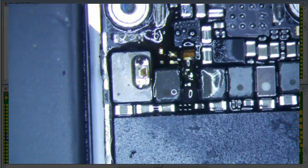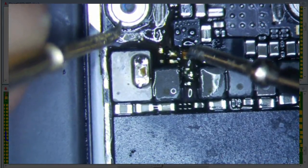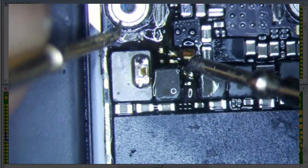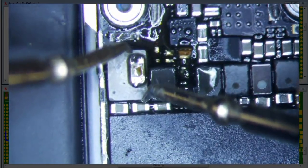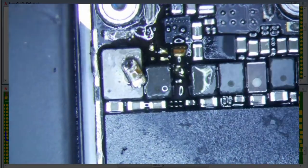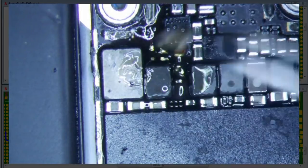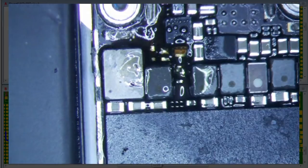And all right, so let's do diode mode one more time, and let's see if the short's relieved or not. That was ground. So this is 0.60. So short is relieved. Let's measure this cap, make sure this will confirm. 0.013. Okay, so this cap is bad as we suspected. So let's put this sucker aside in the trash can somewhere.